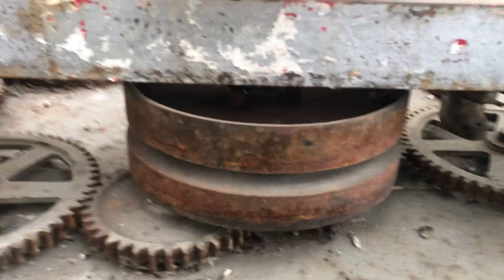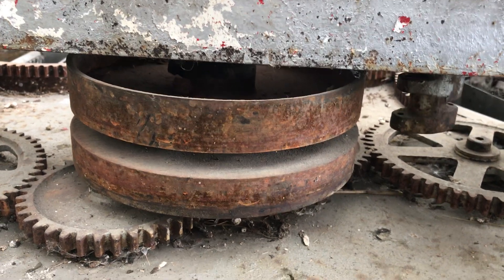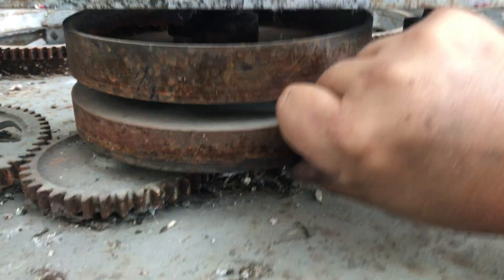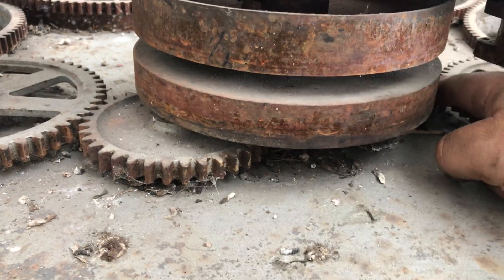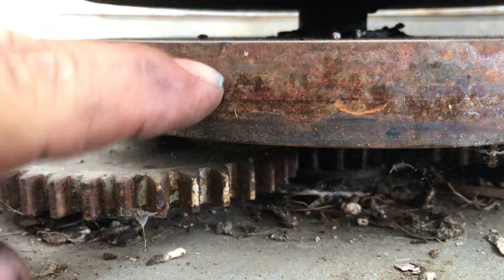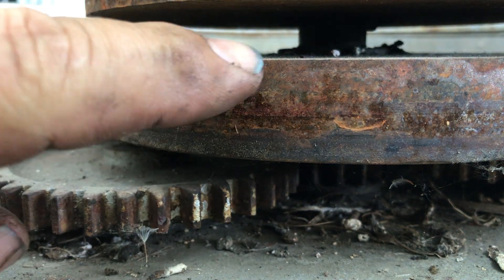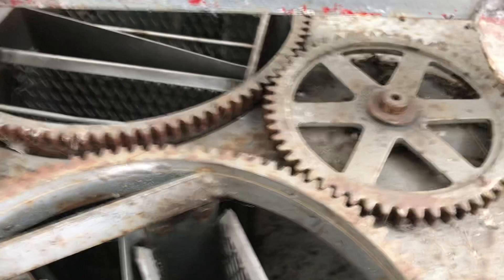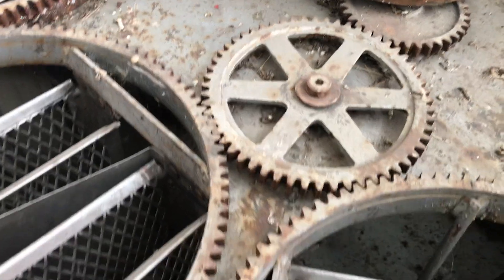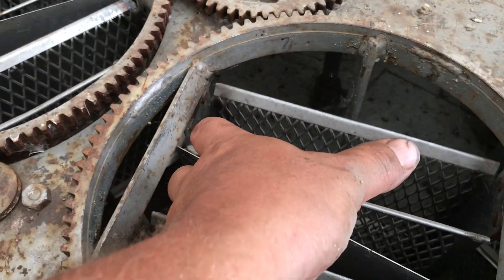Once this is turning, it's got two discs here and there's a lever here. The actual brake bands have been removed, but the idea was that you would turn this lever one way and that would activate the brake. If you turned it the other way, you would activate this lower disc, which is actually attached to these gears. So there's a gear way under there — you can see that. When you brake on this disc, it would turn against the shaft and then transmit that power to this set of gears, which would then turn the baskets. So the momentum of the extractor turning would, at least in theory, turn the baskets so that the frames would rotate one way and then the other.